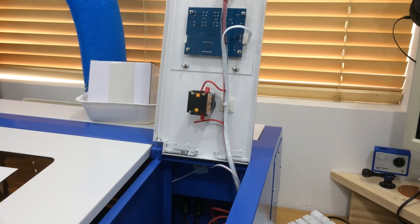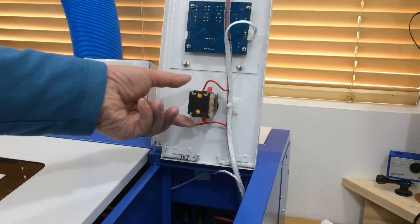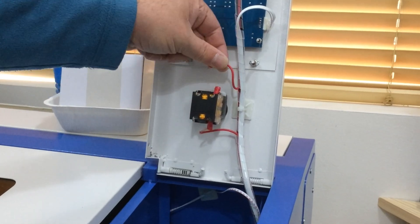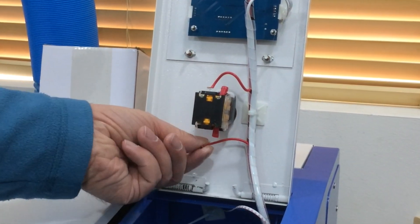Last night I'd been testing the emergency stop button and as it turns out the emergency stop button had come loose, and this allowed it to turn inside the control panel, and that had caused cables to be pulled out of the crimped ends.